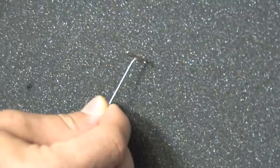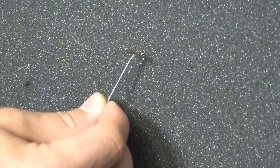There are two main options to use when mounting foam absorption: foam tack spray or tube tack glue. If you decide to use glue, you will need to temporarily pin the foam on the wall with T-pins until the glue dries, usually 24 to 48 hours. You would apply the glue to the panel, place it on the wall, remove it, and reapply it to the wall. This allows the glue to get tackier quicker.